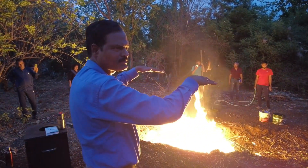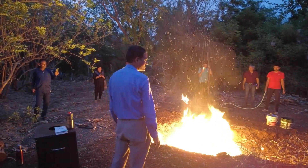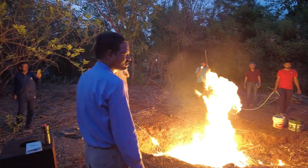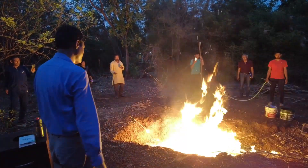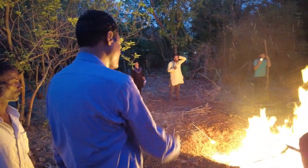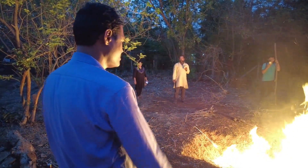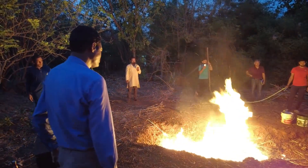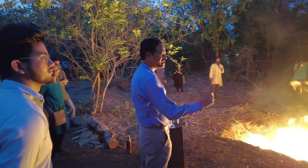For any oxygen to go below and further combust the biochar, it is very hard in this process. Therefore at the end all the biomass is converted into biochar, and by quenching with water we can retrieve it immediately. People are even doing thousands of tons of crop residue like cotton stalks, with at least 5 to 6 batches of production minimum per day in this kind of trench, and on a large scale also they can try. This is one of the quick methods of producing biochar.